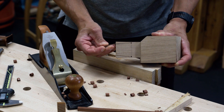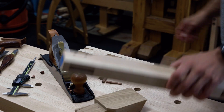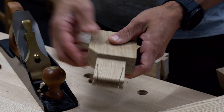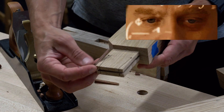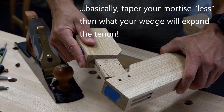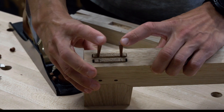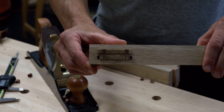The other thing to discuss is that you're putting your wedge into your tenon, which is going to flare the tenon, so you also have to angle your mortise for at least the back half. In my case I've got a 40mm split on my tenon which I'll be driving the wedge into, which means with a 1-in-10 gradient it will be expanding the tenon up to 4mm. You don't want to cut 4mm out of the mortise at the back edge because you want to allow room for your saw kerf, and when you drive the wedges in you want to make sure it's really compressing the tenon fibres by the time it's driven home so that you have a really nice tight joint.